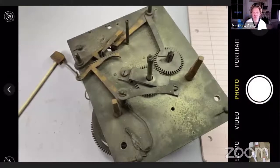And of course, the crazy thing about those is that they don't really help with the depthing problem. People think that by closing the hole, you're bringing the depthing back to some optimal position. I'm not sure that a lot of people make the connection between depthing and bushing. Maybe I'm being unfair. So those punches that close the hole, yeah, they'll move the pivot back a bit, but at best, it's going to be 50%, is that right, between the worn position and the optimal position, given that the optimal position was the original position. So if you see the circular marks, I think they're 20th century.